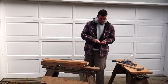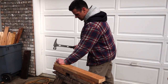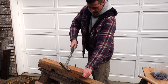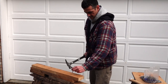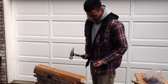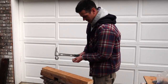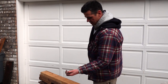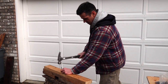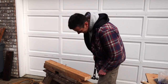We need a new piece of wood. Now we're at optimum height. These are just three-inch bright common nails — no idea what penny they are, that's silly talk, just three-inch common nails. Let me line this up right from the start so I don't have to do that toenailing again. I like this hammer but I am feeling that vibration. Counting strikes: one, two, three — set. One, two, three — set.